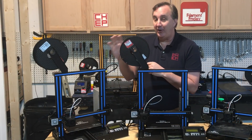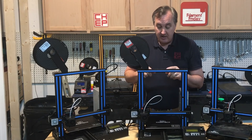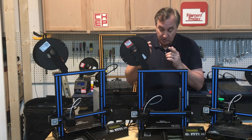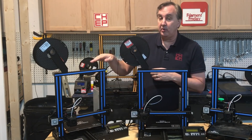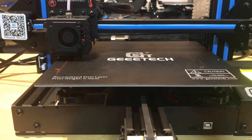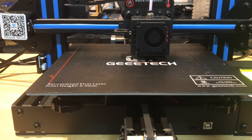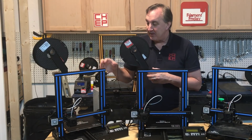This is an early unit and I did find one issue related to the firmware. They're using the same Marlin 1.1.8 firmware on this that they use on the previous model. But when this one homes, the nozzle is actually off the bed and the XY coordinates are minus 15X and minus 8Y. On the earlier model once it starts printing it comes to 0,0 which is right at the corner of the bed. On this one they added a little knob to the bracket so it hits the stop switch sooner, so the nozzle ends up right at the corner — but it still reads minus 15, minus 8. So when it starts printing it shifts over 15 millimeters, meaning every print is shifted and nothing is centered. I tried different G-code to offset it but nothing worked. It's something in the firmware, and I'm told there's a firmware update for this that I just haven't installed yet.